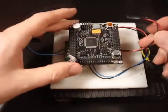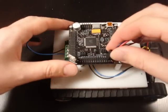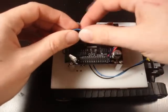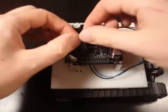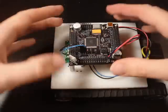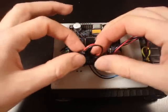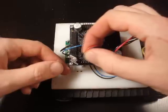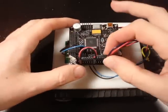Now all we do is connect the wiring. We have battery power going to the motor driver, so I'll connect it here — it can be anywhere on this row. Then I want to connect the serial line because we're controlling it through UART. Black wire to ground, signal wire to transmit, hooked up into UART 0. I also want to connect the battery line to the Axon's battery input. Right now it's set for dual power, but I don't want to bother with soldering on the solder trace for now.